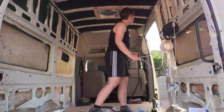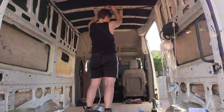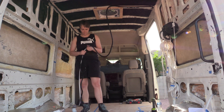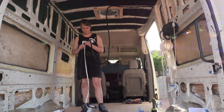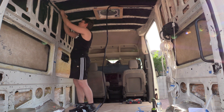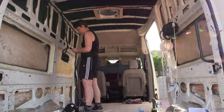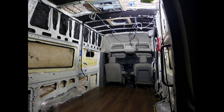The first step was to pre-wire the van. I ran all the wires up and over one part of the ceiling so I'd know exactly where they were. For both the passenger and driver's side, there's kind of one column of wires on each side. The big key when you are pre-wiring is to label, label, label. Make sure you label both sides of every single wire, and label pretty far up the wire so that when you cut back the insulation, you don't accidentally cut off the labeling.